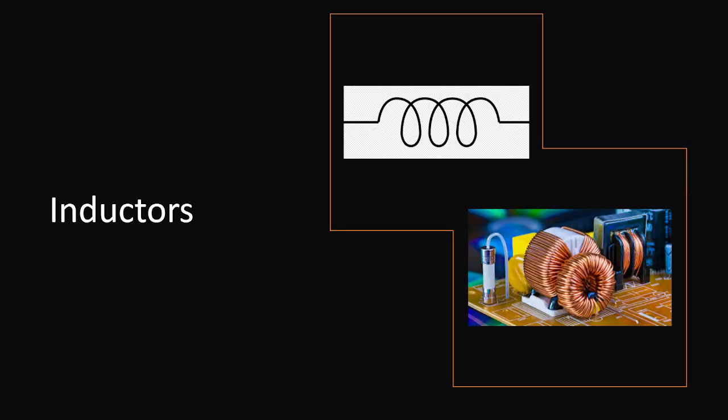Inductors are used to control current. You have this coil that's around an iron core, and it stores current or it stores a voltage in those coils. You have this magnetic cloud that all this energy is sitting inside of. And so when the current starts slowing down for whatever reason, that inductor will then allow more current out. But on the flip side, it will only allow a certain amount out, right? So we rate our inductors to allow a certain current through. So you won't get more, and if it starts going down, that inductor is going to help keep that current flow steady for your device.